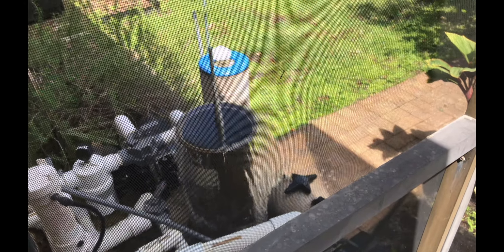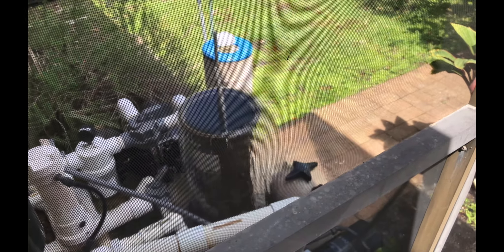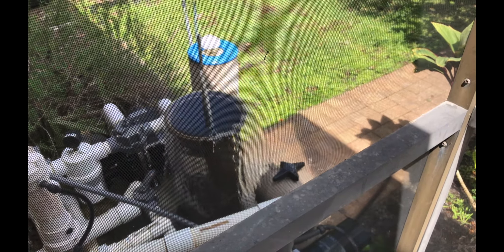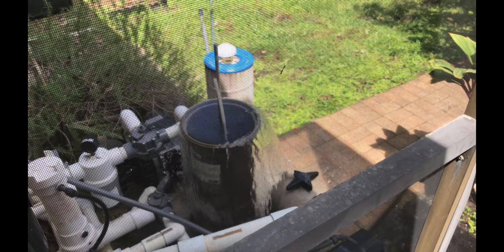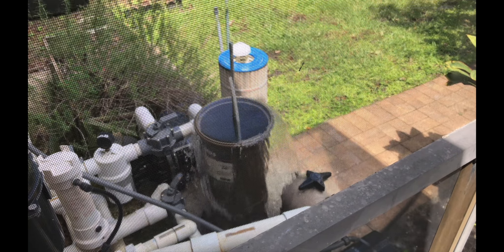So this is one way you could drain the pool without a dedicated drain line when clients don't want to put one in and you need to lower the water: take the lid off the filter, run the system, and it will overflow and lower the water at the same time. That's how you take care of it in a pinch. As always, like and subscribe, and have a great day everyone.